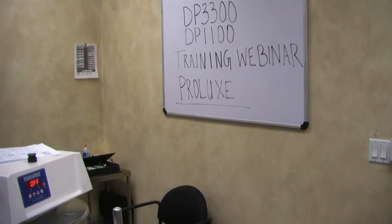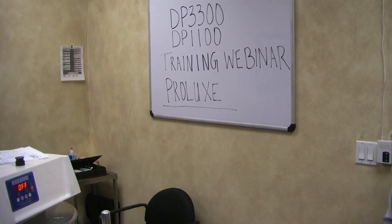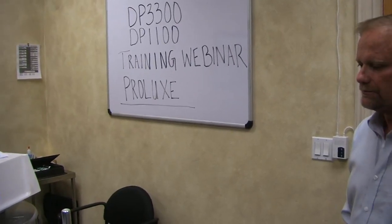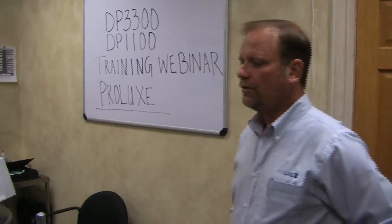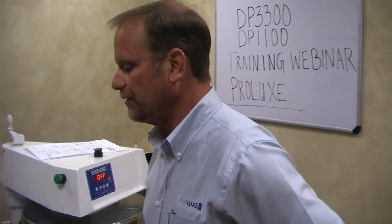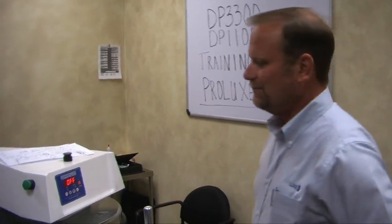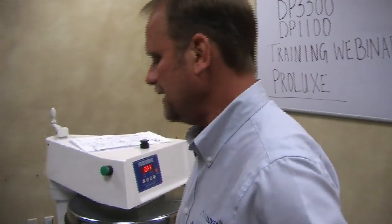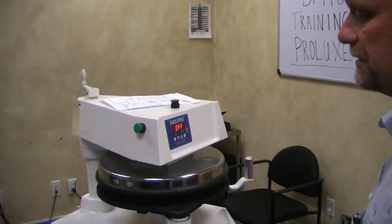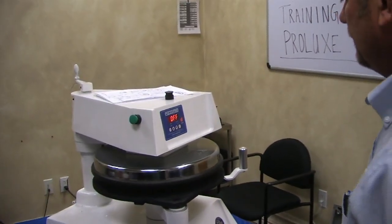So the issue then is if they undersize the compressors when you start seeing, I just want to make it simple, stupid for when our guys go up and look and they start seeing this type of wear or issue, if it's undersized is when they start seeing this problem, correct? Correct. Or they haven't drained their tank and the compressor in 2 years, you know what I mean? Yeah, I do know what you mean. So it's not a real big deal, and eventually they're going to need a piston rebuild just because of the use on it. We need to get in there and re-grease it, re-lube it, put new O-rings on it, and that's after quite a while, unless they really have a wrong setup. So anyhow.